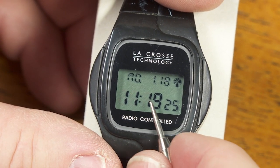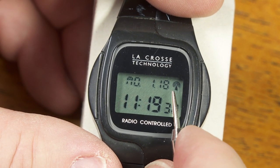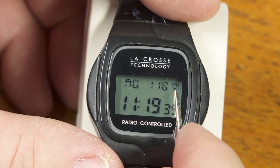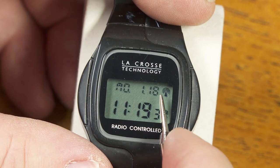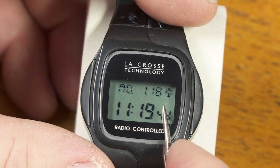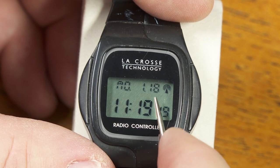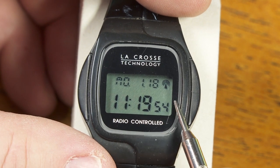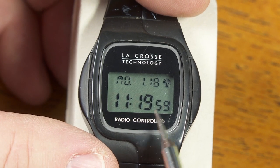It times out after just a few seconds. This will try to set itself overnight every night, and you'll either see that icon there or not. If this does not receive information from WWVB, then it won't set itself at all. But if it is able to set itself once and then it's not able to receive any more after that, it will continue to run as a quartz watch with typical quartz accuracy. Since I live just one state away from Colorado, it's always done really well receiving time from WWVB. But as you can see, this is all it does.